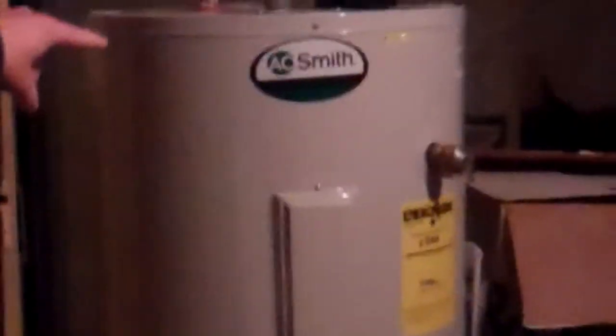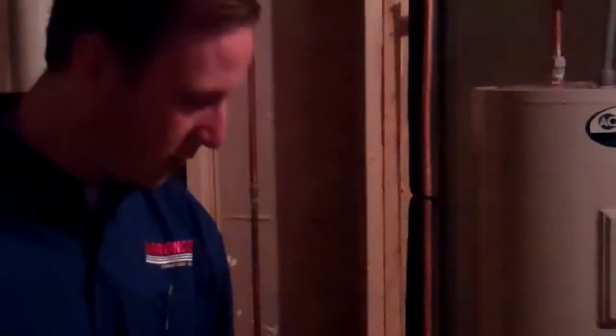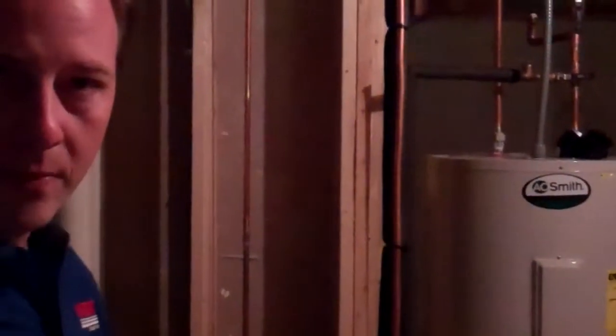You see these 2 additional pipes here. They're actually tied to your water heater. One of the pipes is pulling the cold water off the top of the water heater. Anytime the air conditioner is running, or the heater, it's running inside the unit helping to keep the motor cool. Well, as it's cooling the motor, it actually heats that water to 120 degrees, and it's going in the bottom of the water tank here, essentially replacing the water heater heating element. So anytime you're using your heating and cooling, you're getting free hot water, and it costs nothing. It actually aids in the efficiency of the equipment.